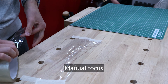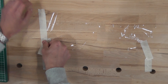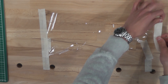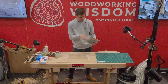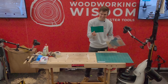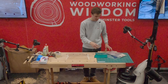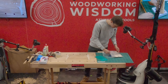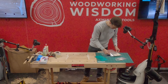For the veneers, you want to use standard 0.6 millimetre thick veneers. You can use natural wood if you just want natural tones, or you can use dyed wood. Dyed woods are normally poplar, which is very light and takes stain really well — you get the colour throughout the veneer and it hasn't got a very prominent grain, so you can cut it really easily. It's perfect for veneering. I've got some pre-cut tiles here just to speed things up, but I'll show you how I cut them.